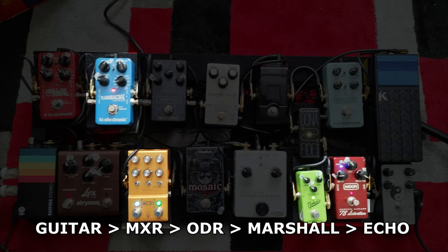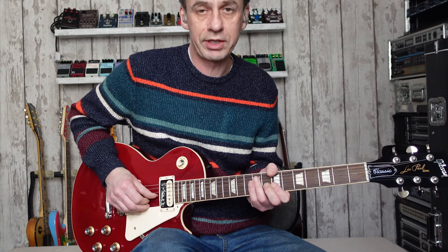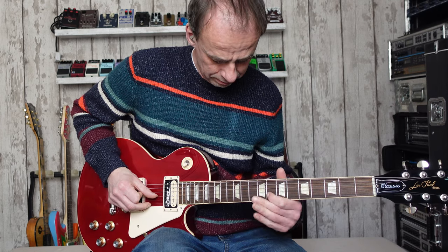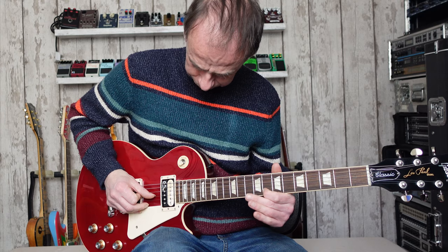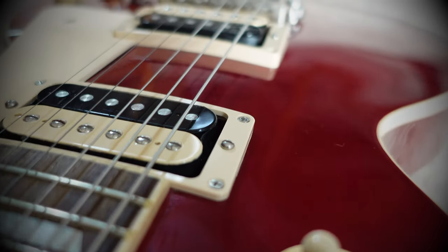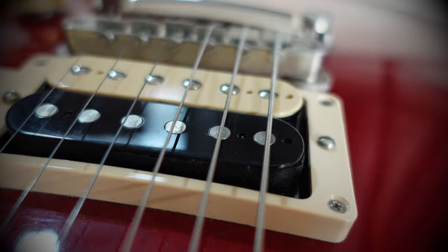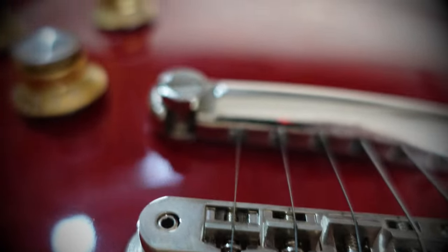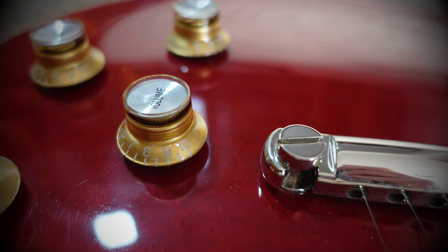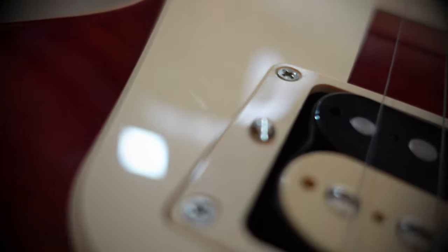At the moment I've got the tone on 6, so we're just in flat-out humbucker mode. As usual the guitar comes with BurstBucker humbucking-type pickups. The coils are uncovered and exposed — I'm assuming they're Alnico 5, that seems to be the consensus. The front pickup is a 61R and the rear pickup is a 61T, so they're zebra coils. The output readings: the front is 7.94 kilo ohms and the rear is 7.9 kilo ohms.